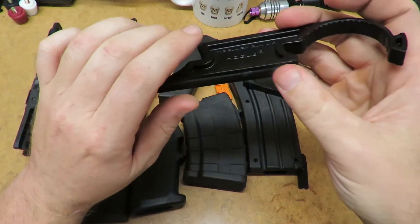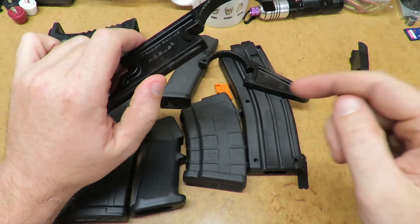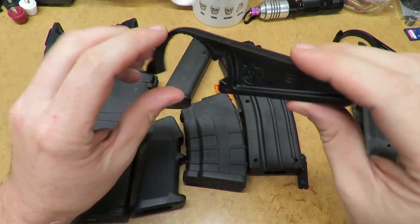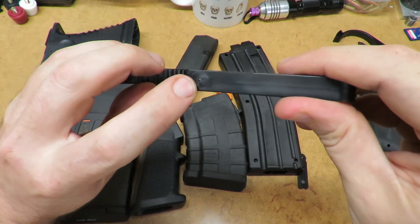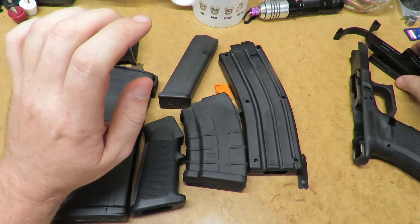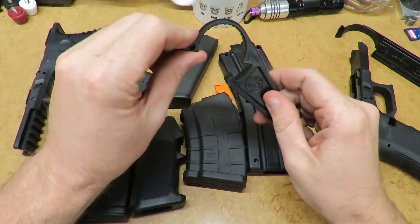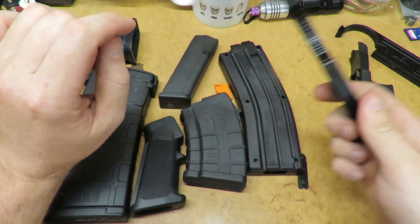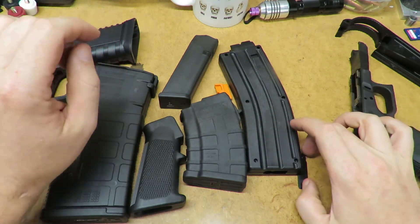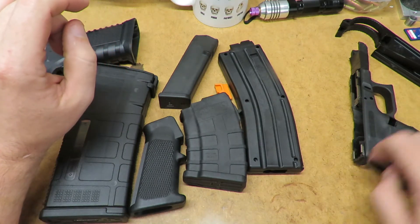On the other part you'll see this little gnarled spot — that's the injection port, the opening on the mold where the plastic goes through the head and into the mold cavity. All parts have those. You can also tell polymer parts because they have a good deal of flex without breaking — a soft flex, unlike cheaper plastic parts that feel like they're going to break when they flex.